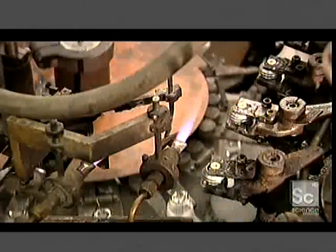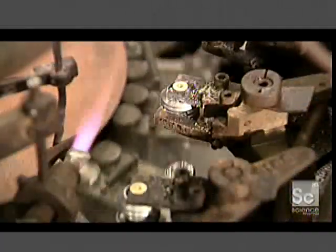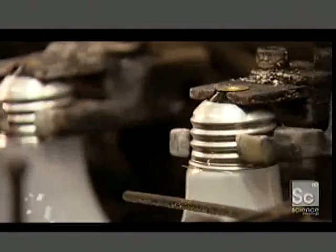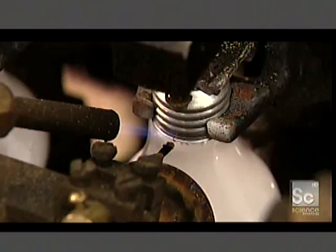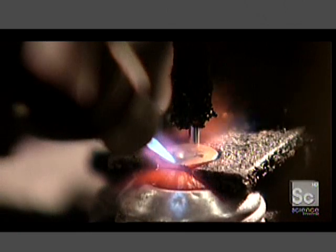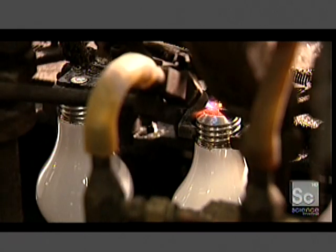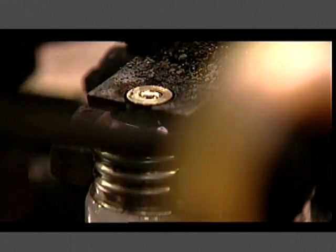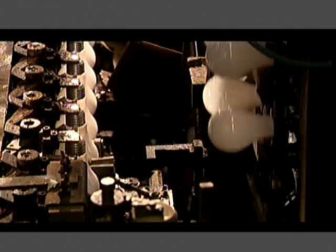The base is made of aluminum. This machine inserts one of the bulb's lead wires through the middle and solders it in place. It then spot welds the other wire to the side. The result: two base contacts to line up with two socket contacts.